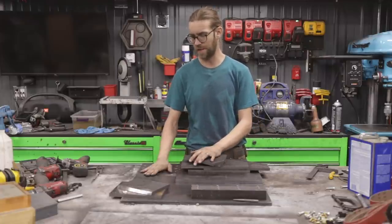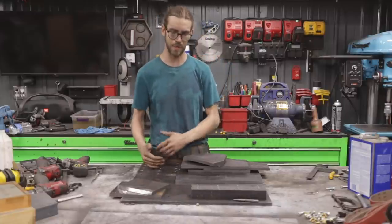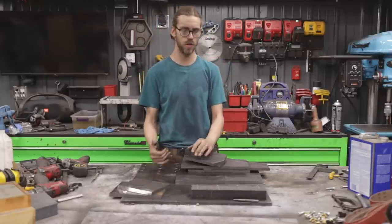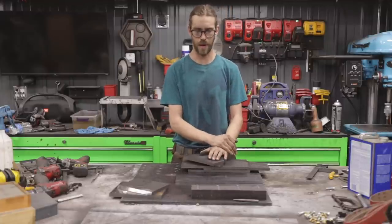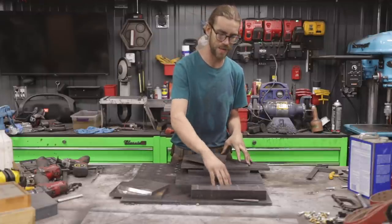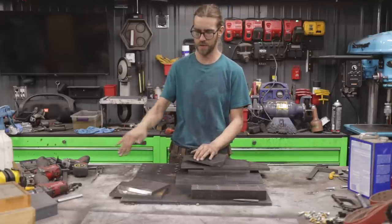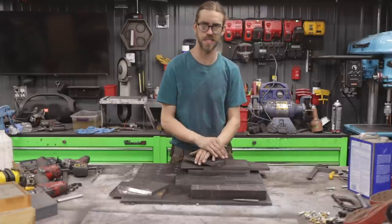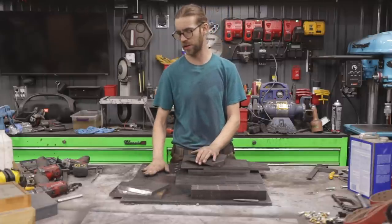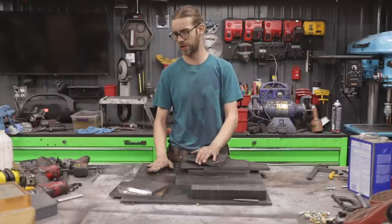The only thing that I have not dimensioned is this plate here for the receiver. I'm intentionally leaving this long, so that way when I decide to do the tensioning mechanism, I can integrate that as much a part of this piece as possible. I don't wanna cut this off right now and then decide that I'm gonna have to add a little extension, which I would have originally liked to be as much a part of this as possible, just for rigidity and strength.